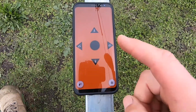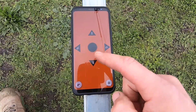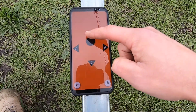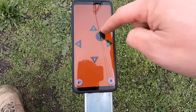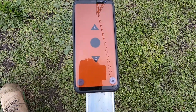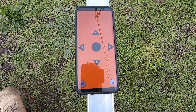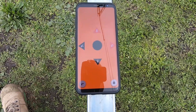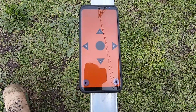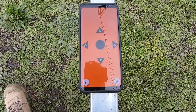For the web interface, I went with a joystick design that lets me control both winches simultaneously with a single input — up/down moves the hook, left/right raises and lowers the boom. The best part is controlling both at the same time. I can also disengage the boom so I can't accidentally move it when I only want to move the hook. The interface gets feedback from the crane too: if the boom reaches its limit, it indicates on screen and prevents moving the hook or boom up. There's also a lock mode so that putting the phone in my pocket doesn't accidentally trigger the crane.